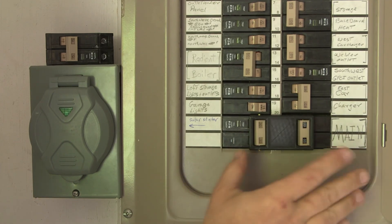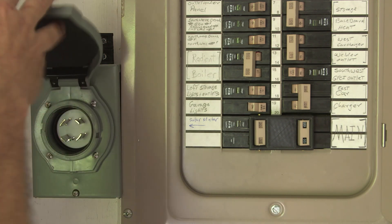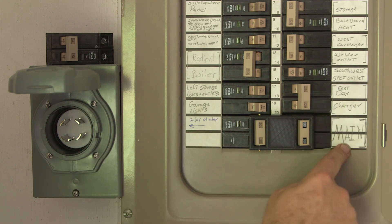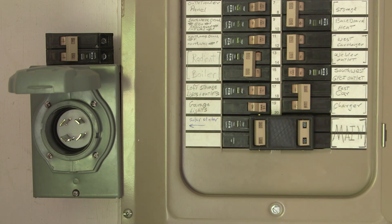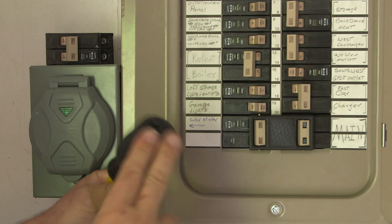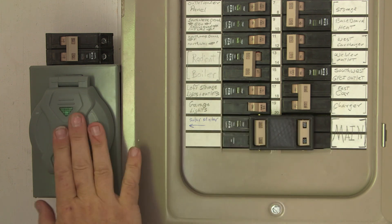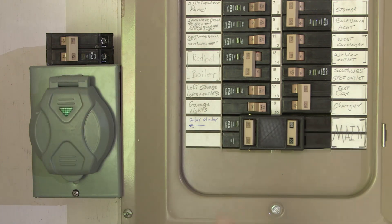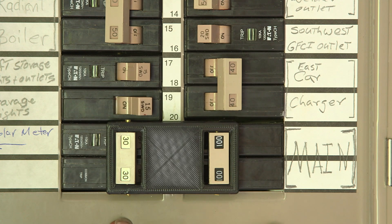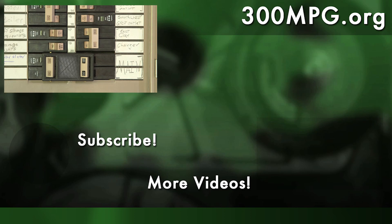Remember the reason why we're doing all of this is so that we can't have the main breaker on passing power to here where somebody could get a shock by touching those, or have power coming in from here, connecting to the main breaker, going back out over the grid and electrocuting somebody. So as it is right now, we should only get power from the generator cable into here. The other thing I want to point out here is that circuit breakers like these will still pop even if they are connected to another breaker or even locked in the on position — that's just the way that circuit breakers are designed to work.